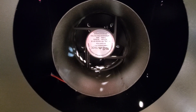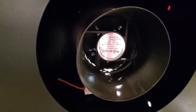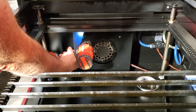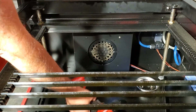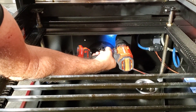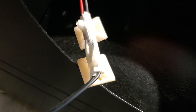This is a close-up of the fan from the outside of the machine. You can see there's a long flange attached to it so you can attach the hose. There are four metal screws that hold the fan in place from the inside, so you need to take those out. When you remove them, the fan assembly will fall down inside, and that assembly is removable through the outside hole.